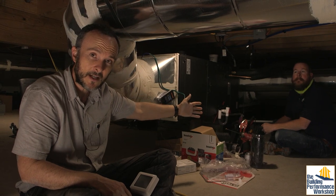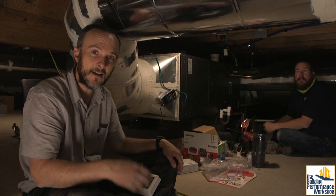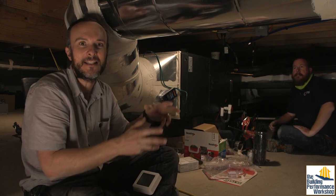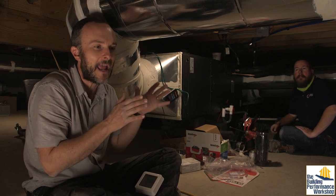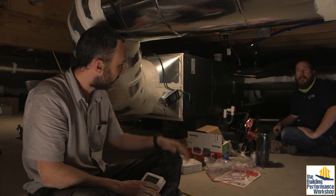If you call a professional who knows what they're talking about and ask what kind of testing they do, they'll rattle off a list. Brent is also running MeasureQuick on this system — just like we did on the last one — a performance test to tell how many BTUs the system is actually moving, how many CFM it should be moving, and how the liquid line, suction line, pressures, and temperatures are supposed to be working versus how they actually are. Turning real life into a laboratory — which you can do nowadays with these Bluetooth tools — lets us be everywhere in the building at once.